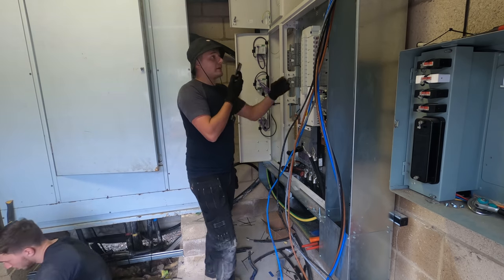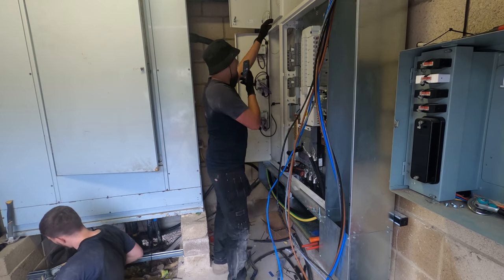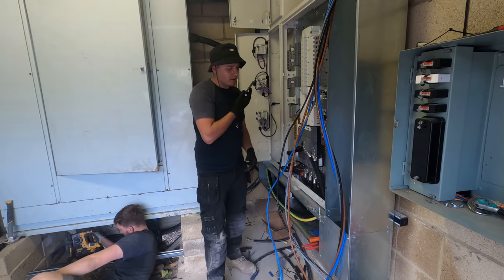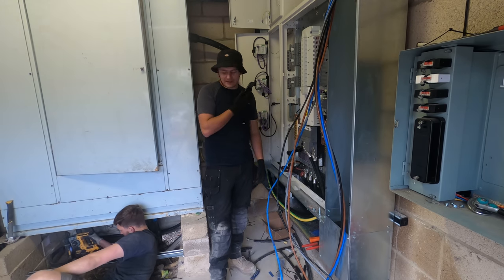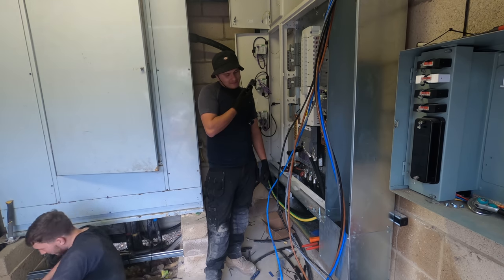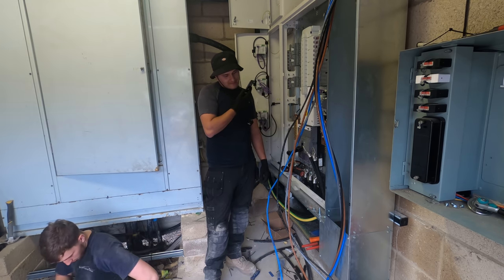And then I've managed to nick two 50mm bushes from this isolator so I can get these two feeds in. I'm just heat shrinking them again. Where we pulled them out... Okay, we are completely done, apart from banging this SPD in.